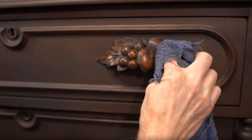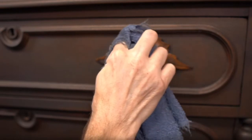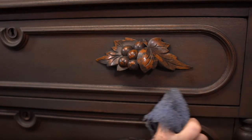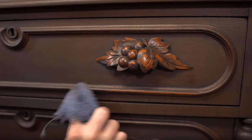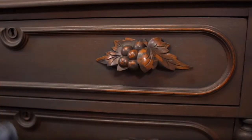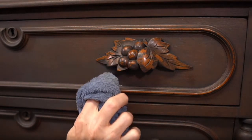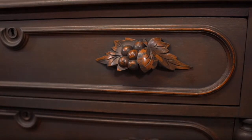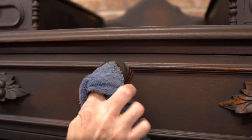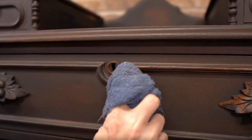The wet rag is almost acting like sandpaper, but I'm not disrupting or hurting anything. So you rub off as much as you want shown. It should look like maybe over time the piece is worn. Your call — and remember, I can always come back and either add another color or take a little second. We'll just rub around the keyhole, and whatever my finger touches, that's what gets removed. This is what we would pretty much call wet distressing.